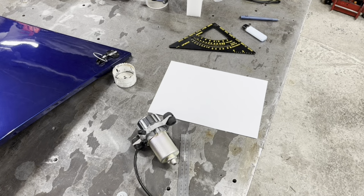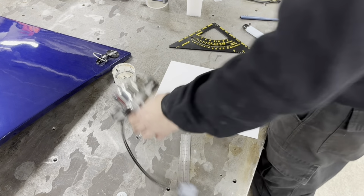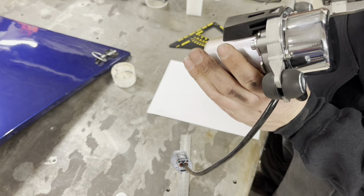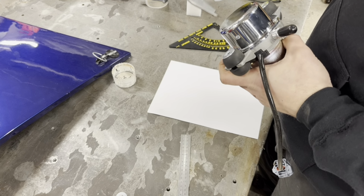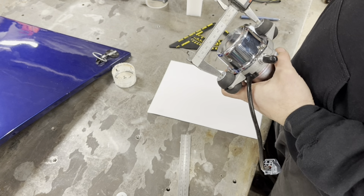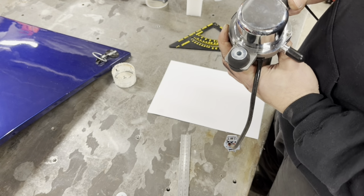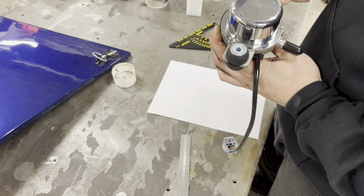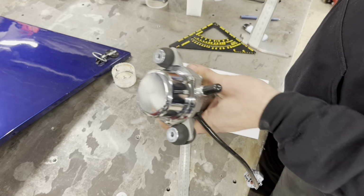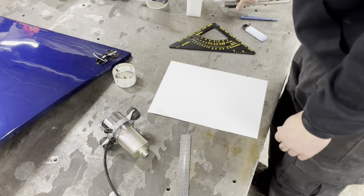So anyway, let's get this mount bracket made. So we'll take the front end off and we'll start designing it up, shall we? Right, so what we're going to do on this bracket is start with our known, which is this 6mm. So we know 101mm is our centre to centre. These can come out, but they can't go in really. So we'll go 101, say we'll go 102, we'll leave us a mil. So our centres on those holes are 102.